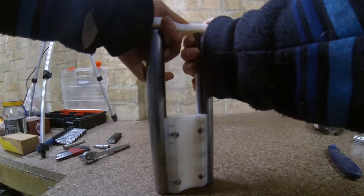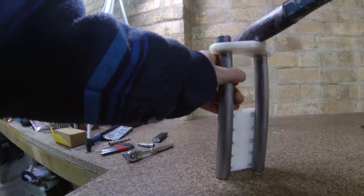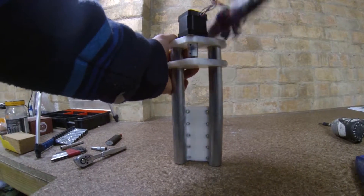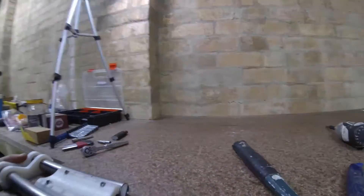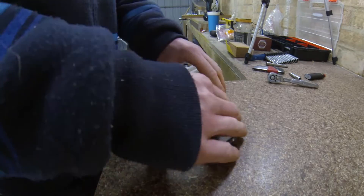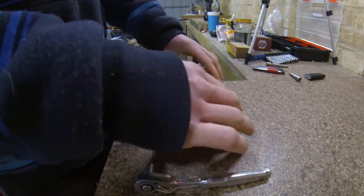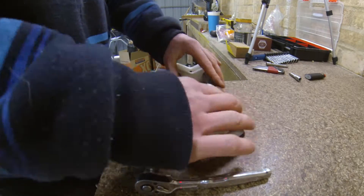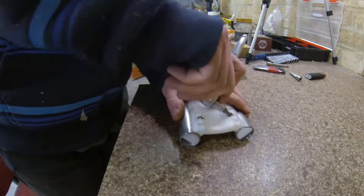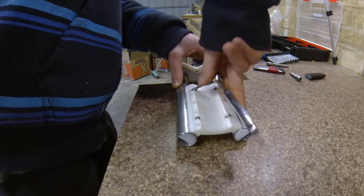With the tool mount installed to the pipe, I'm now installing the Z lower plate onto the assembly — I'll just lightly tap this down with the handle side of the hammer. After installing the Z lower plate, I then went and installed the Z motor plate above, bringing the plate down so that the spring coupler just lightly touches the bearing on the Z lower plate. After which I placed the whole assembly on a flat table to check everything was flat. It took a fair bit of tweaking back and forth, and I found that twisting it in both hands until it sits flat was the easiest way.